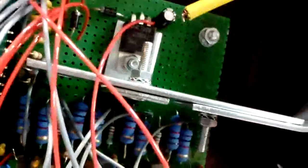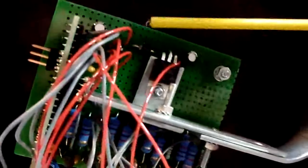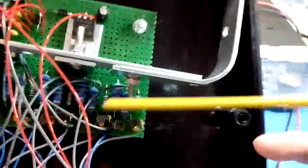So furthermore, if this thing will focus a bit, yeah. Furthermore, there's a 7805 linear regulator right there that converts the input voltage to something usable by the digital logic. There's a diode, so 2 inputs can go to 1 output for the logic voltage. Capacitor. Wires going to switches on the front panel.